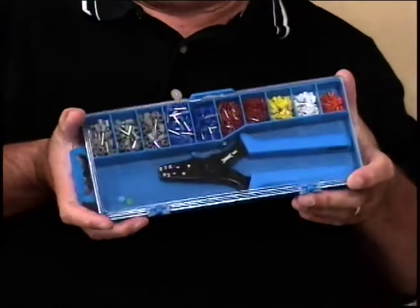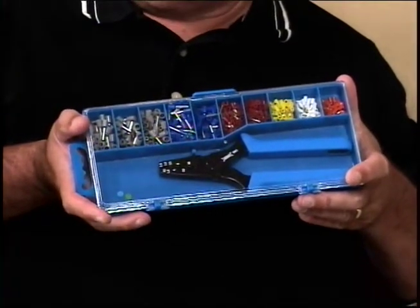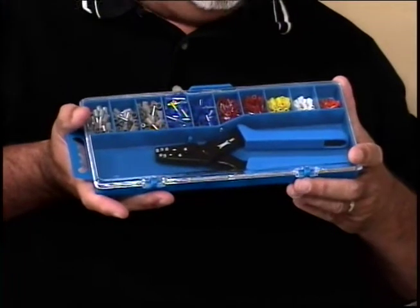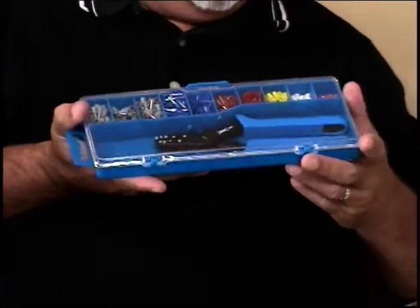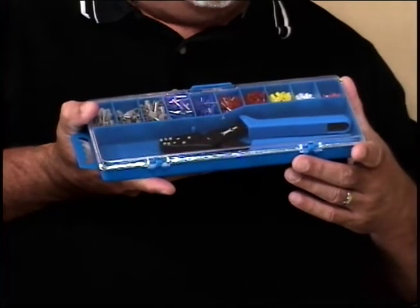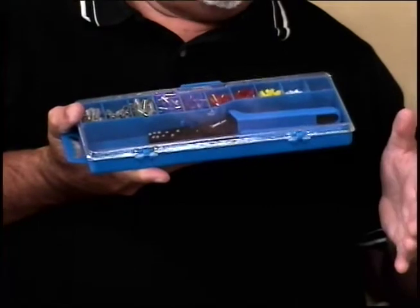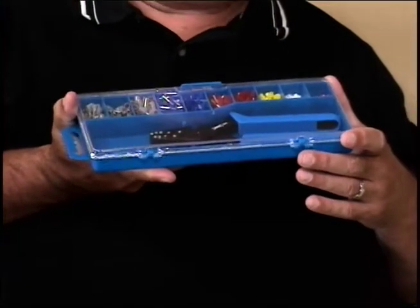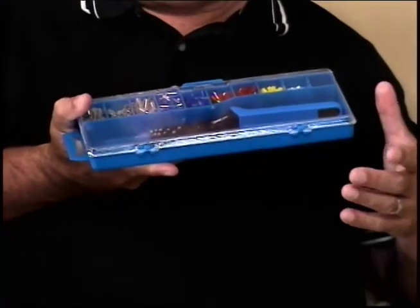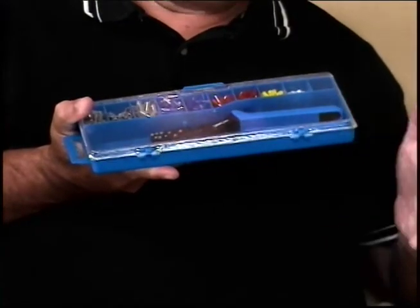Good. This guy, if we can see it in the camera, the kit comes with the crimp tool, but also a set of ferrules. And just in general practice, long story short, in my career, when we made connections, we'd strip the wire, and we would always use stranded wire, because in machine tool with vibration, if you use solid wire, you nick the wire after a period of time because of vibration, and the wire would break. Right. So the policy was always stranded wire.